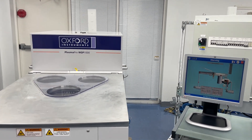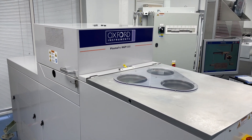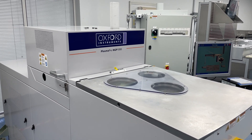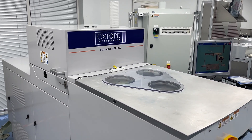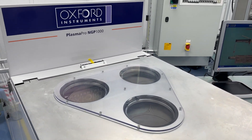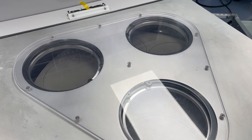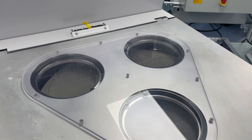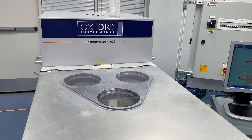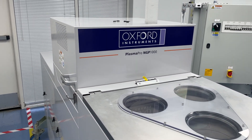This is a 2012 system. It has the large electrode, so it's got a 490mm aluminum lower electrode, which allows it to process up to 300mm wafers. You can see here where the platen is. It's currently set up for 150mm wafers, but we can deliver it to run just about any wafer size you're looking to run on this system.